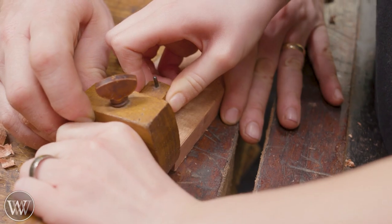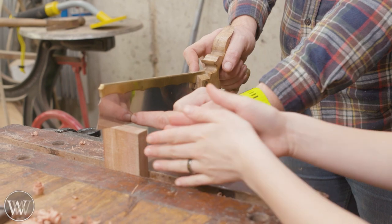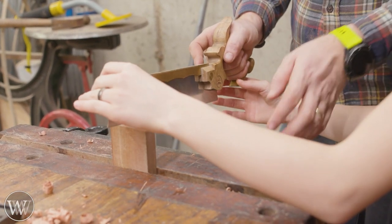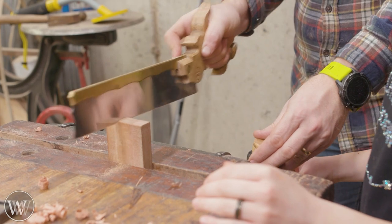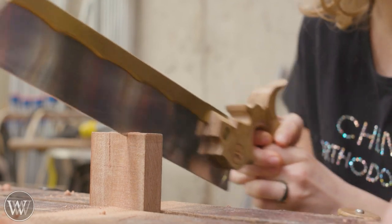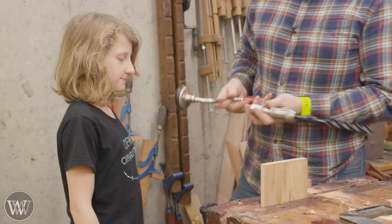On the end of the arm, we're going to create a notch that the vertical fits into. We can show how you can guide the saw by looking at its mirror reflection — you look at the reflection to see if you're straight up and down. Here you can see one saw mark that is at an angle and another that is straight up and down. She's looking at the mirror image and keeping it vertical.